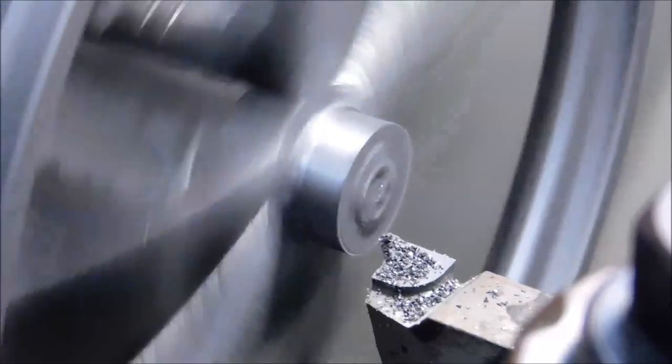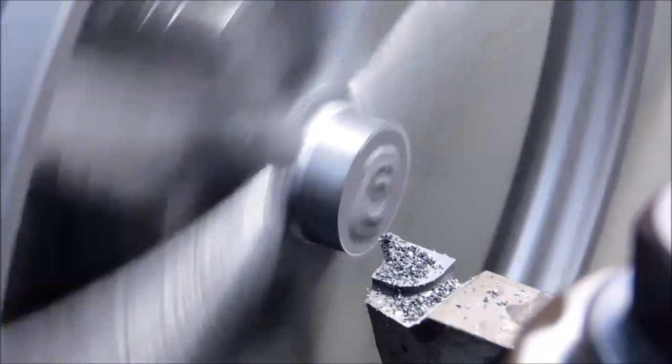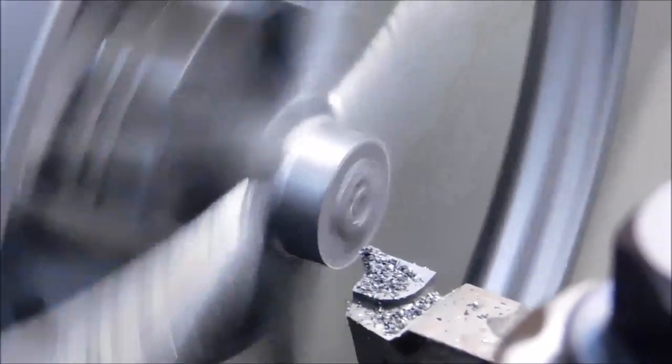You can see the reflection in the small 45 that the tool left in the part, the eccentricity that was removed. I'll make sure this is a nominal size before I flip it around, and I may just put it back in a collet for the next operation. We'll see. Stay tuned.